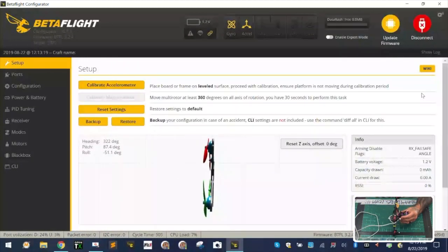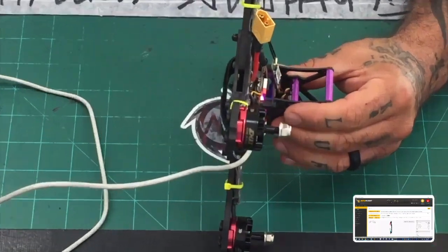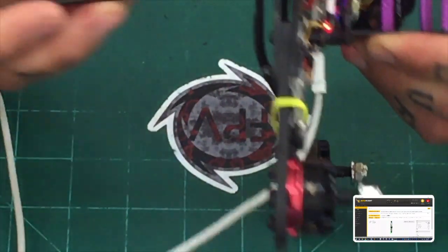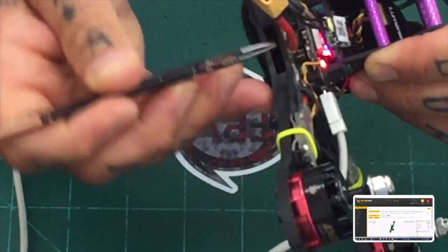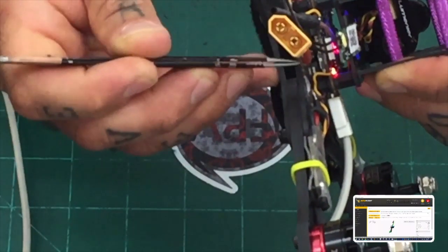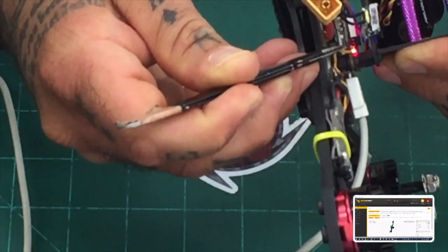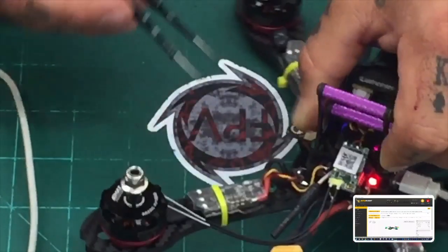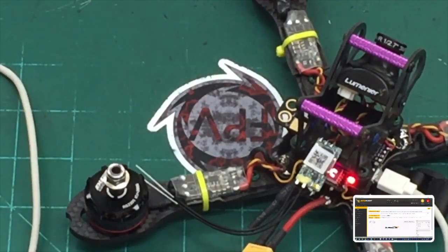I am going to keep the video off on this board. It does have onboard VTX as you know, and there is a white switch right here. If you look at the digital readout, right under it is going to be this little switch that goes back and forth. When you push the switch that way — to the left, away from the lipo pads — that turns off the VTX when you plug in your lipo. I'm going to do that so that I don't lose a video signal.